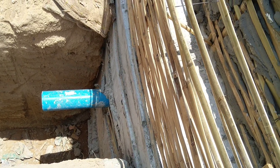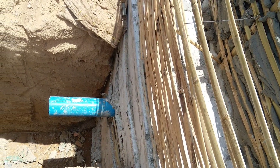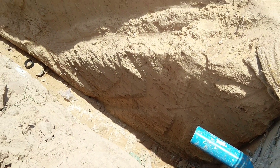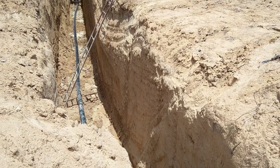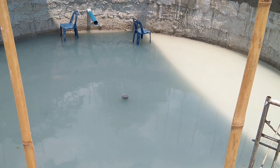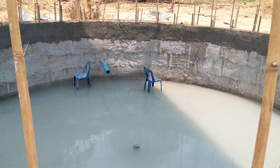And then the drainage pipe — if you build on top of the hill, on the high area, we need to dig a trench so we can drain water very well from the tank. The drainage pipe has to be at the bottom, very low, at the lowest area. It's good to pour the concrete and slope it toward the drainage pipe.